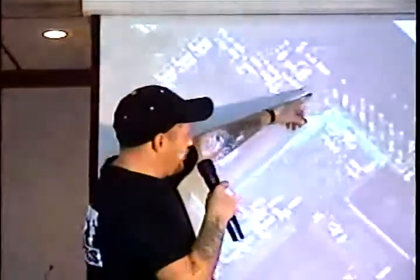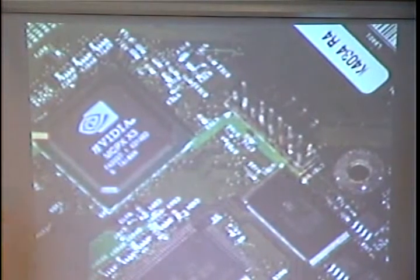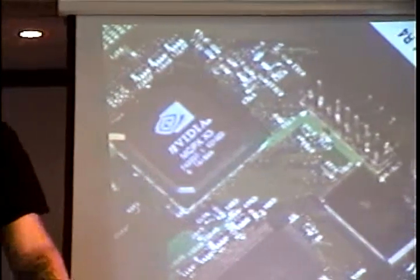This area right here where I have a pin header that's soldered in is what I refer to as the LPC. I'll be able to show you better on one that doesn't have a pin header in it. Cheap mods will cost you about $10, and you can modify your Xbox. Now, there's a lot of soldering that's required to do a cheap mod. That's why I don't prefer to do it. You have to solder to the socket for the BIOS and to the motherboard, so it can take some time, and if you're not real good with soldering, it's probably not a method that you should choose.